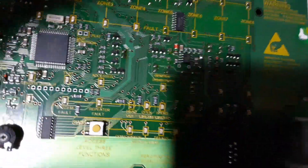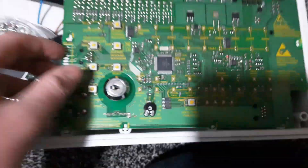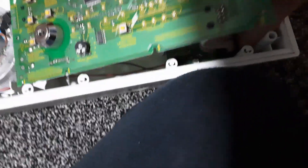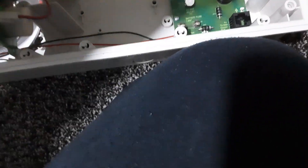Now that light's out, I'm going to take this main board off. To do that you need to unscrew everything. Once that's done, disconnect the power cable — there's just a little tab here, you push down and pull it up. So that's the back of a CTEC CFP.